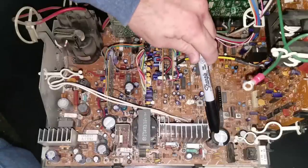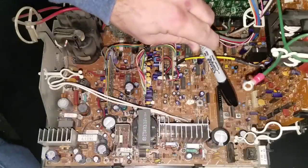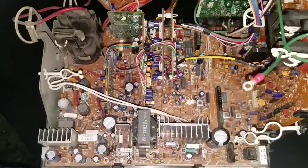We'll also go through here and change out these larger capacitors on the chassis. It looks like these boards don't have a lot of capacitors to change that we would be concerned with. Maybe one of these boards down here — I'm sticking my Sharpie on it — we'll get some caps changed on it. And again, we're going to clean this board thoroughly.